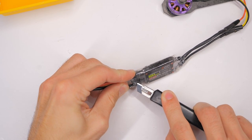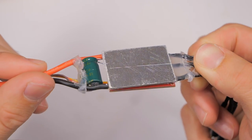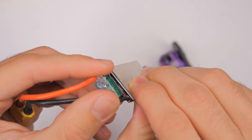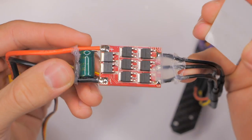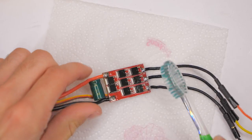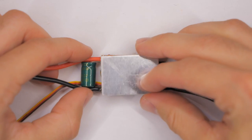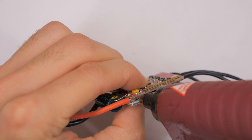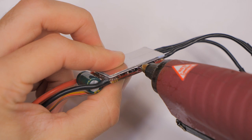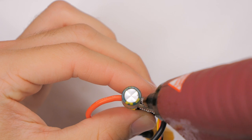Next, I wanted to see how well it worked to apply the hot glue directly to the board like I did with the other coatings, in case you don't have heat shrink tubing or don't want to use it. So I cut away the rubber heat shrink tubing and removed all the old hot glue. Then I removed the metal heat sink that covers the FETs. The heat sink is important to help keep the ESC cool, so I first covered the pins of the FETs as a secondary layer of water protection, then put the heat sink back on in contact with the FETs and glued around the edges, leaving most of the heat sink plate exposed to dissipate heat.